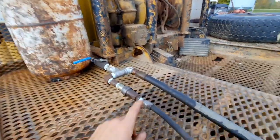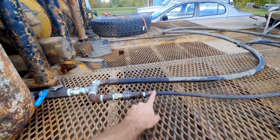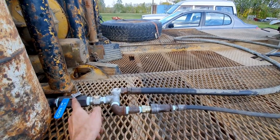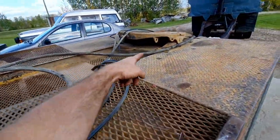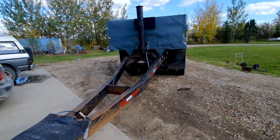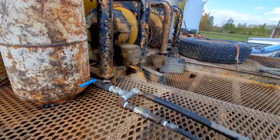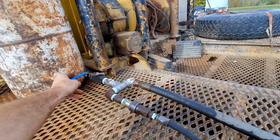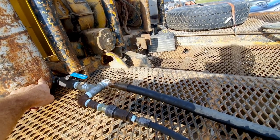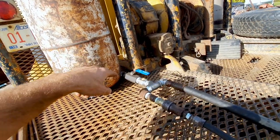When my hydraulic valve is closed, this is the pressure side. So when I pull the lever back, it pushes oil — instead of going into my old dumps, because this is closed, it goes through and follows the big line into the pup to raise the box. But you can't release it backwards through that oil, so when it's raised I can stop, open this valve, and the pressure will bleed back into the tank. I ran it through the corner of the tank so it's not foaming — it'll just swirl.